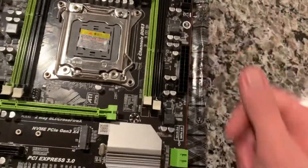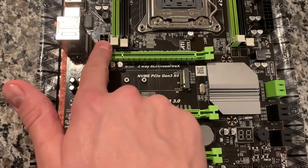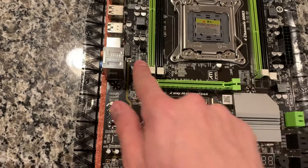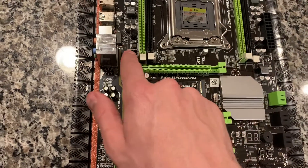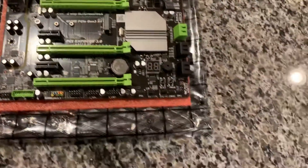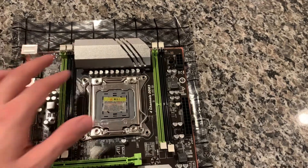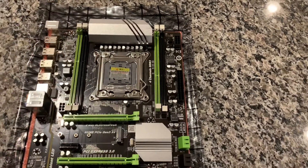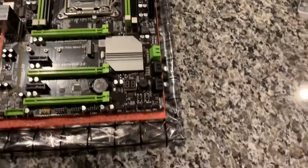You have your standard 24-pin power and 8-pin CPU power. There's also a 6-pin connector here — there's some confusion about this. I don't think it's for adding voltage to the motherboard; on some boards an extra 6-pin or 8-pin powers the PCIe slots, but I'm not sure. It might just be an extra power wire for the CPU. As for the VRMs, this is better than some single-phase boards people complain about overheating. I think it's called an 8-way VRM — something like a 6+2 configuration.